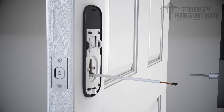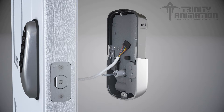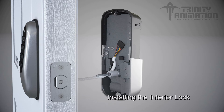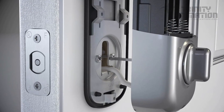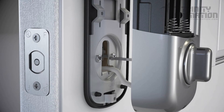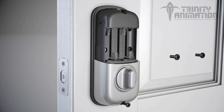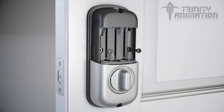Now install the interior lock assembly, beginning with attaching the wiring harness. Make sure it is seated properly in the plug. There is a small guide on the lip to prevent you from getting it reversed. Next, we will retain the wire with the black clip as shown, to insert the tailpiece into the thumb-turn shaft assembly. You will want to ensure the tailpiece is in the horizontal position to properly engage the latch. Once attached, adjust the wire to allow the interior of the lock to sit flush with the plate assembly. Make sure you have pressed the interior escutcheon firmly into the rubber gasket on the plate assembly. You will need to insert two screws inside the battery cover and one screw in the bottom of the escutcheon to attach the inside escutcheon. Tighten the screws in the latch face. Do not over-tighten.